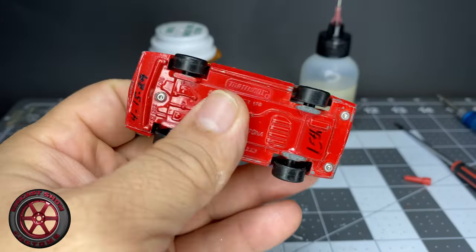But now I'm ready to strip the paint and see if I could fix that roof. See what happens. All right, to close out this section, if you're using the incorrect tap, like a pointy one like this one, remember you're probably cutting down, so you have all the debris going down. Then you have a tap that can't go all the way down. You're trying to force it, and that's how you end up breaking the taps. So make sure you use a bottoming tap like this one.